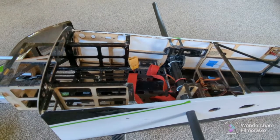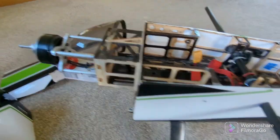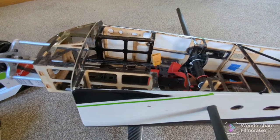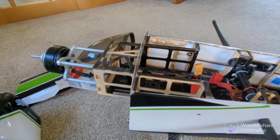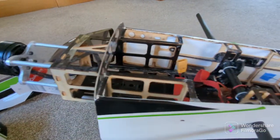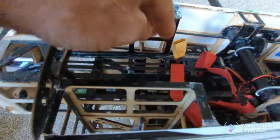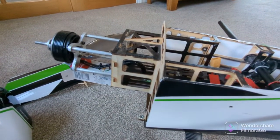But to be fair on them, I think it's partly to do with the Chinese who make Dual Sky motors and Dual Sky ESCs haven't got the history like Castle Creations. I shouldn't say cremations, it's a bit unfair. They haven't got the history like Castle. And Castle, to be fair on them, and brilliant, hats off to them, they have dealt with it. They put software in so you can monitor ripple voltage. They've made capacitor packs, what you can solder in. That's where I got the idea from. And if it wasn't for Castle, I probably wouldn't have known about this phenomenon of ripple voltage.